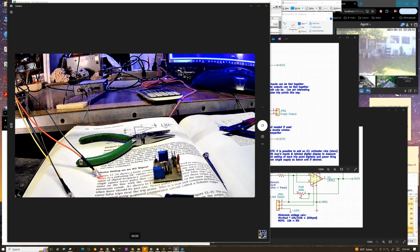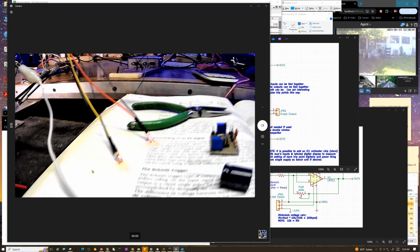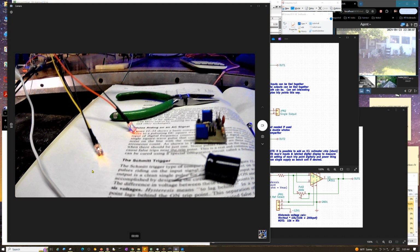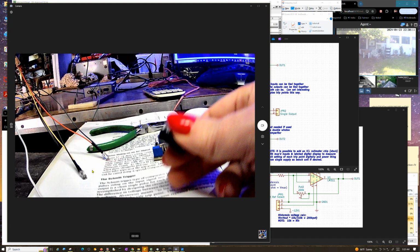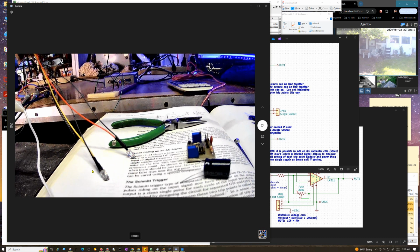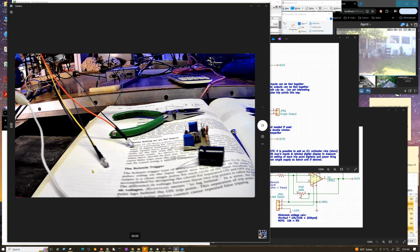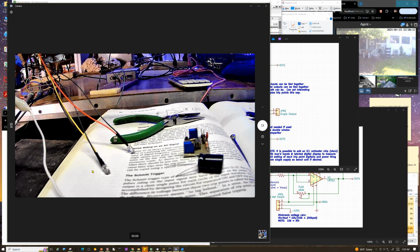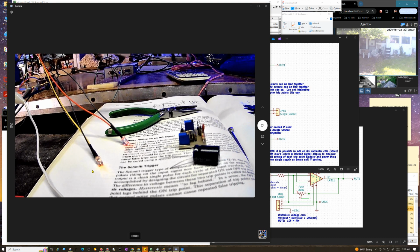So anyway, that's what it looks like at lower frequencies. You can see I've got it reduced down to like 5 hertz or something. So again, it's not a pretty waveform with this capacitor, and it was like perfect with this. When I was actually generating a waveform, I could generate down to pretty low frequencies with just that alone and no voltage divider. But there was always a negative diode voltage drop across it.